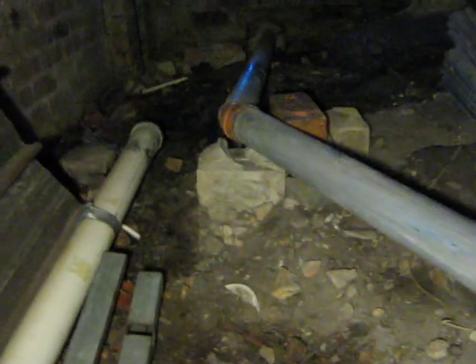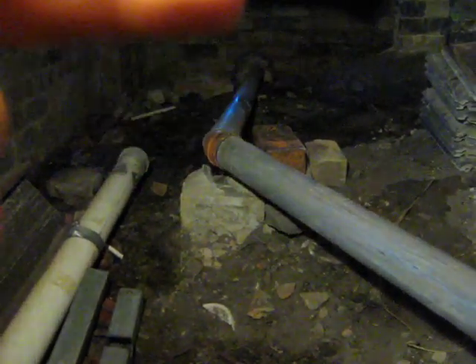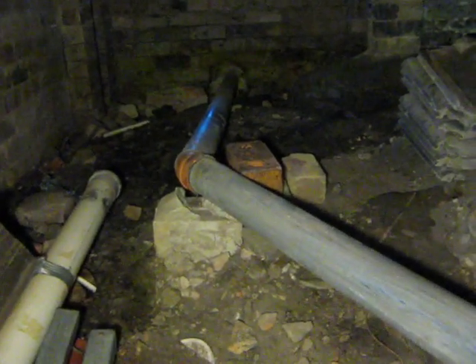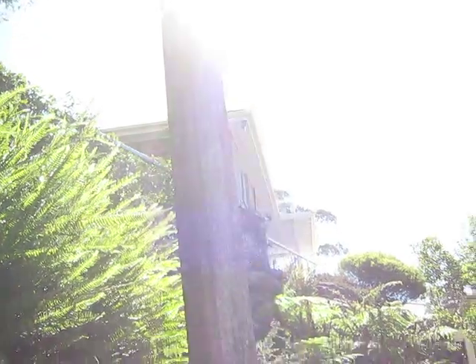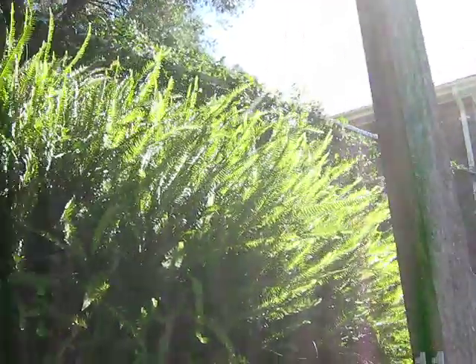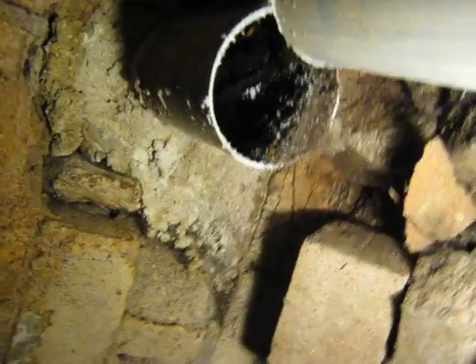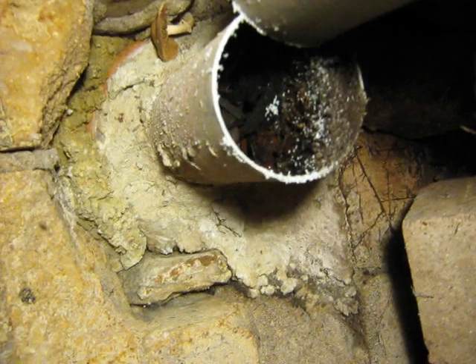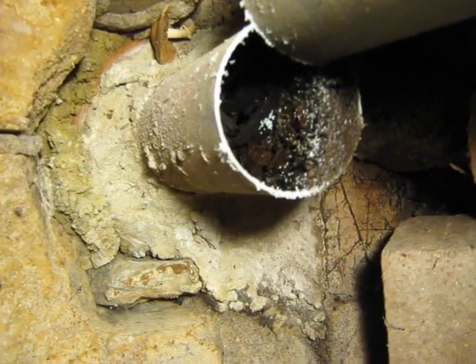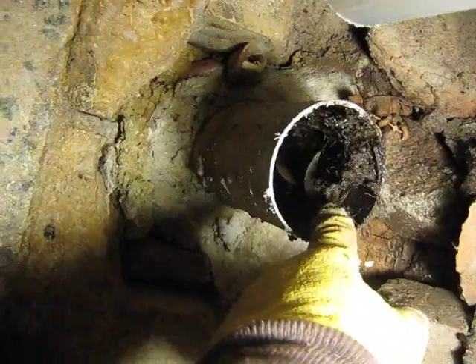Water is exiting the drainage system somewhere and just draining out underneath the house. What I intend to do is cut the pipe just near the exit to the outside of the house and just see what's blocked. The plumbing comes from the house along and drains out there, exiting into this pit here. You can see the problem — that's the exit side of the pipe and it's full of leaves, dirt, and all types of debris.